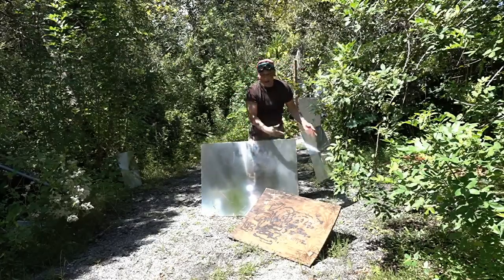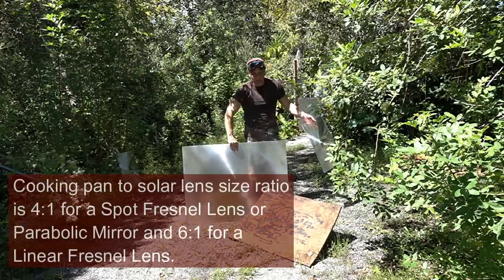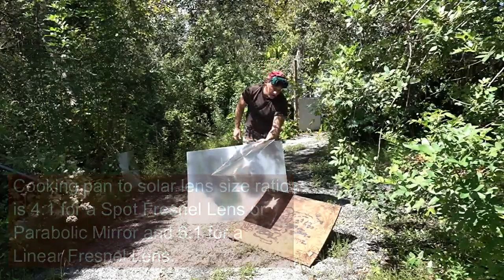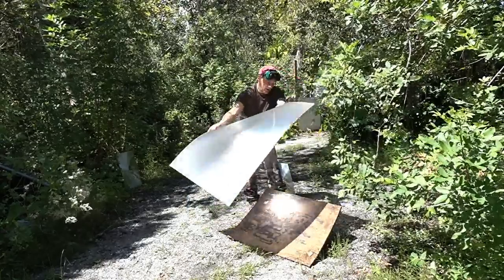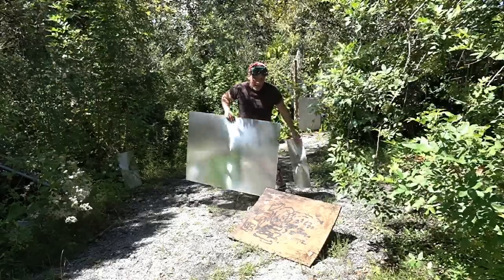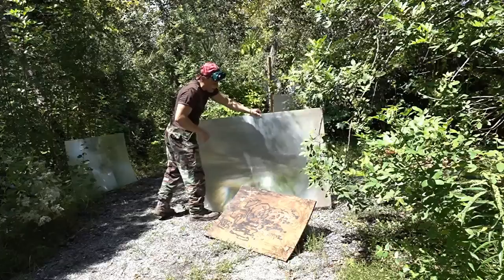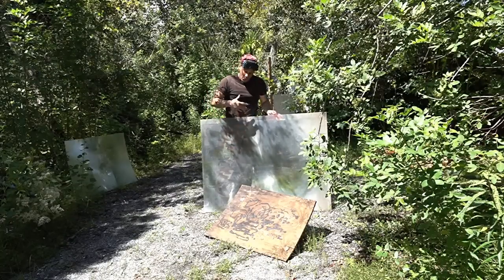So the larger the lens, the more power you're going to get. And if you're concerned that it doesn't catch stuff on fire right away, that's not usually the goal — you want to heat stuff and use it as a solar device. So larger is better, clearer is better, and they have a trade-off. This one can cook on about a six-inch frying pan and get it up to roughly 300 degrees Fahrenheit. This larger one can probably do the same on an eight to ten inch pan — it takes a little longer to build temperatures, but in the long run it's more like an oven. A lens like this would be a really good one to use; it's not the clearest lens we have, but it is one of the larger ones.